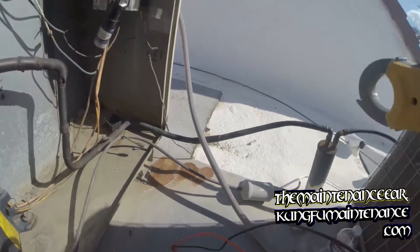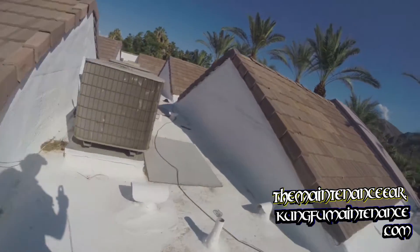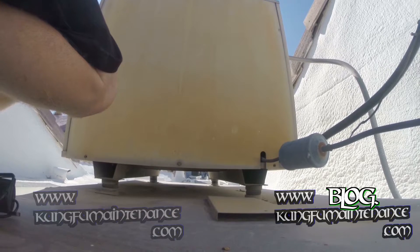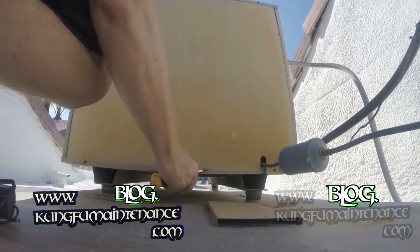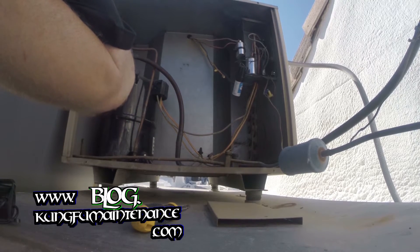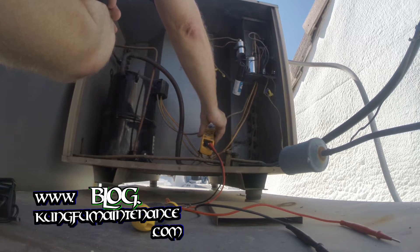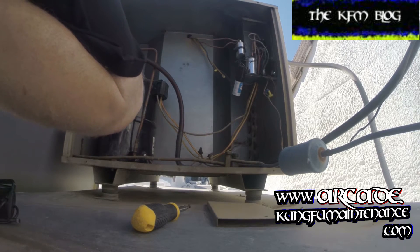The other thing I could do is measure another unit just to get a comparison. I've got one right next to it. I'll pick one that doesn't have an Edison box on it. The other thing on that first one was that red wire — the terminal could be replaced. So we just want to clamp one wire, and I'm on amps AC. We're at 13, 14.4 there. This compressor is kind of on its last leg — I've done a few rounds with this one before.